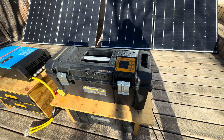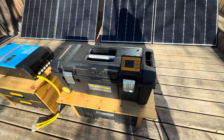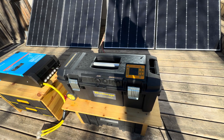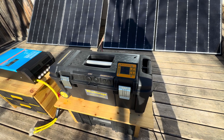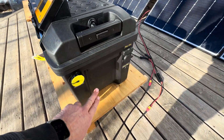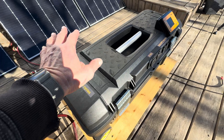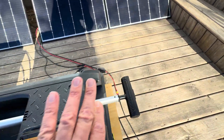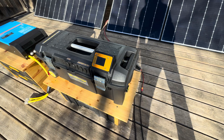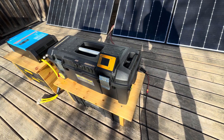The mindset here for this 24 volt battery is for someone who puts it in a trailer and pulls it out during the winter months, maybe having it in the house during emergencies. This setup is just with this type of case. I love that it has an indentation on both sides — I can take a ratchet strap, pull the handle out a little bit, put the ratchet strap through, then put the handle through it so the strap doesn't move. It's nice and secure but not impossible to take out.